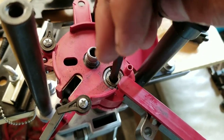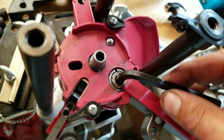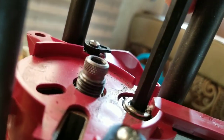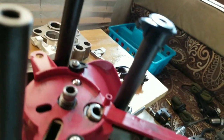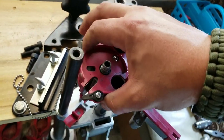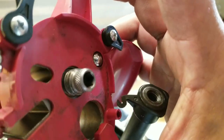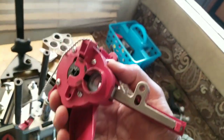You'll see that slot in the middle of the carrier RAM — that is not for a screwdriver. That's actually for strain relief for the carrier assembly itself. Once you get this loose, you'll notice it's going to hit that plastic overlay. Just get it to where it loosens up and it's free-floating. After that, grab the carrier assembly itself, make sure your priming arm is out of the way, and lift up. Make sure you don't snap off that little hook for your case feeder. And there you go — the carrier assembly is off the press.